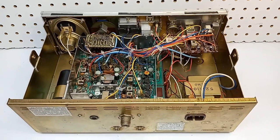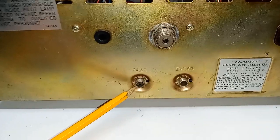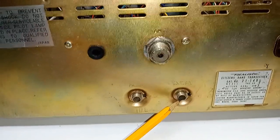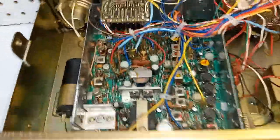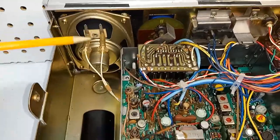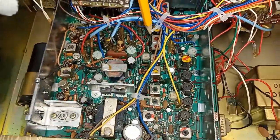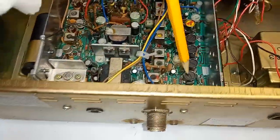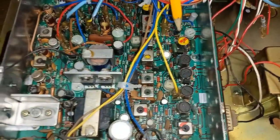Let's see what makes these Navajo Pros tick. Looking at the rear apron, we've got a multi-connector that provides both an AC or DC input. We've got a 1/4-inch phono jack for the external PA speaker and another 1/4-inch phono jack for the external radio speaker. And, of course, the SO239 for the antenna connector. There's also some nice ventilation here. Inside, we've got a nicely shielded power transformer, a rather large 4,000 microfarad DC filter capacitor, a really nice layout, and a front-firing speaker. The light bulbs are easy to service. And then we've got the traditional 455 kilohertz IF strip with one mechanical filter. Here's the sub-receiver IF strip — a 255 kilohertz IF strip with different size IF cans.